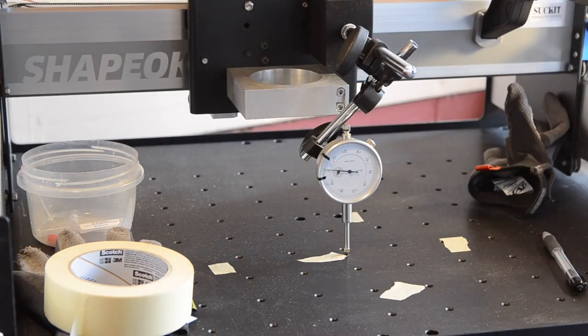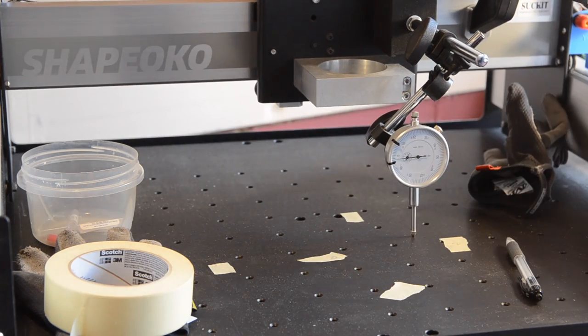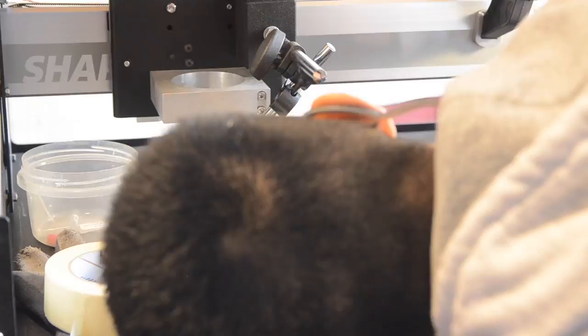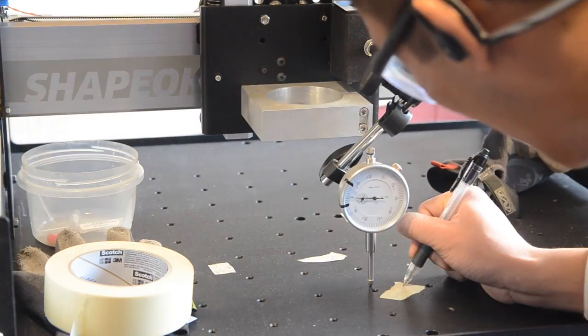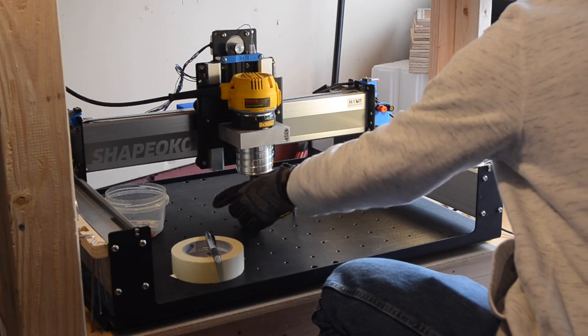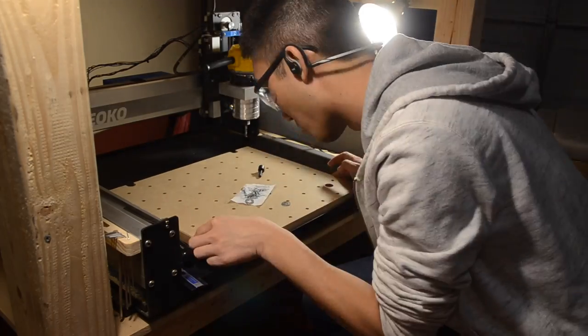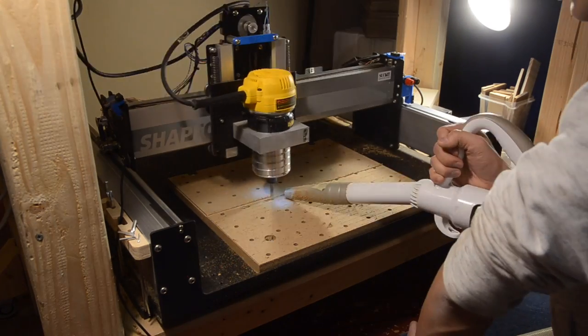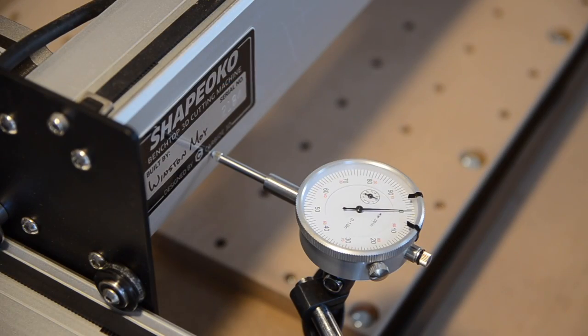You can measure the existing depth variations of your wasteboard and subtract out those offsets when you measure your spindle squareness. This works best for people with low profile dial indicators, but you can still use the poor man's spindle square and feeler gauges to do the same thing. Then, once you get your spindle square, you can face your wasteboard and it'll be perfectly smooth on the first try.